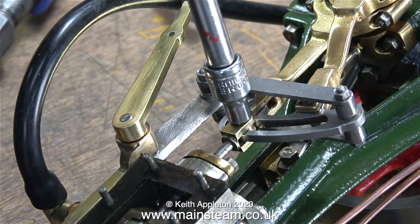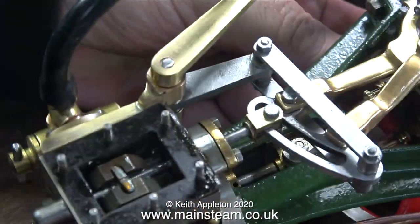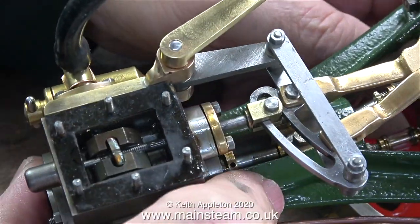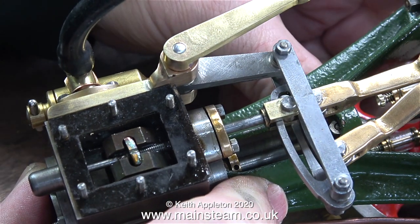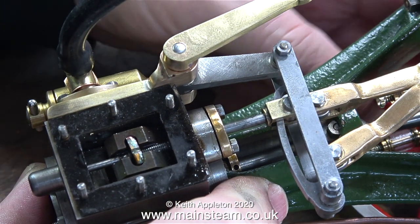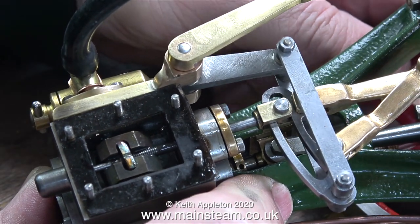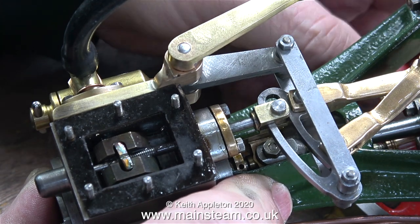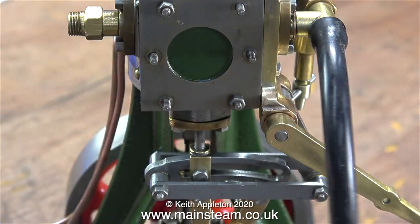After making the minutest of minute adjustments, I refitted the valve fork and the die block to the expansion link and checked the valve events one more time. Some viewers may be thinking the valve gear is not fully assembled and is wobbling about — that's why the valve timing is out. No, that's not the answer. I'm showing all this in great detail because it's a very common problem, but it never happens with valve gear that I make.